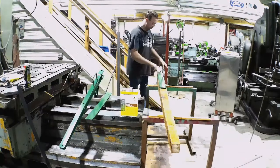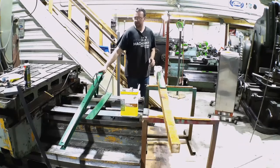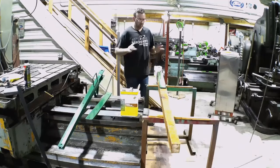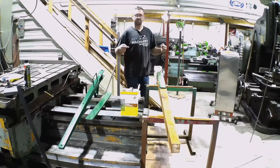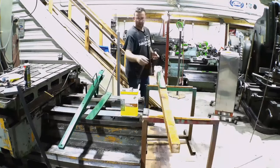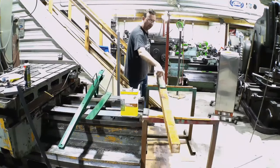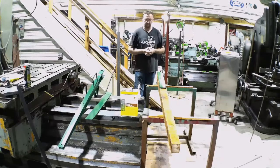All of our pieces are made — the flat bar reinforcing bars for the sides, and the tongue piece — all made, painted up, and ready to go. Now we've got to drill through and I'll use a threaded rod, some half-inch B7, and I've got square nuts so it looks period correct. We'll drill through here with the threaded rod, and then the same thing for the tongue going this way — it will actually interlock back there so it should work well. Let's get set up and start drilling.